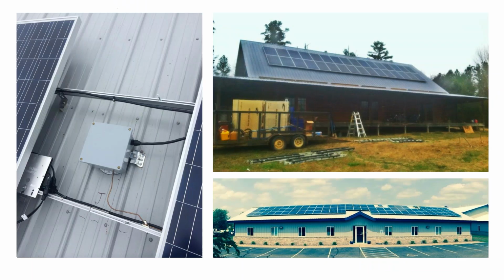And so what that means is by the time you get to putting in the hole in the roof where the cables will go down through, you can kind of see our flashed pipe boot hidden underneath this box right here. But generally, if you want to do a nice hidden internal conduit run, you cannot use a box from Home Depot, Lowe's, or Menards because it won't fit underneath the array.